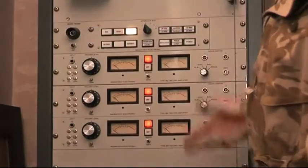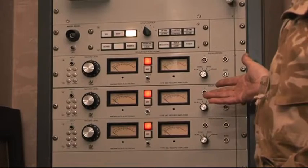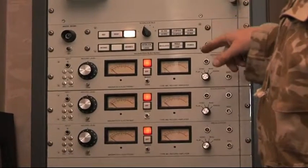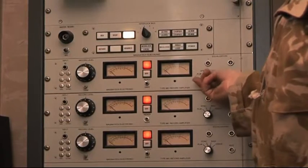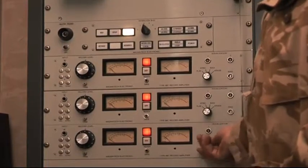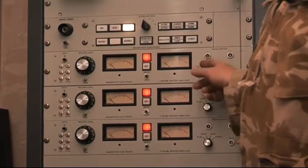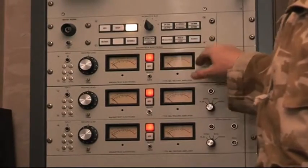and I'll hit record, so you can record on this machine. Because there isn't a head in it, it's not supplying any bias. So the erase and bias oscillator aren't providing anything, so I suspect that the interlink has stopped them from oscillating or sending out a dry signal.